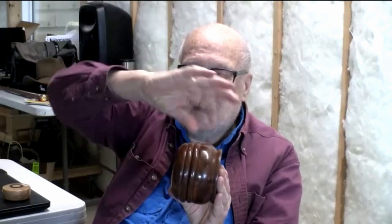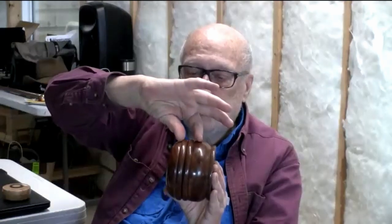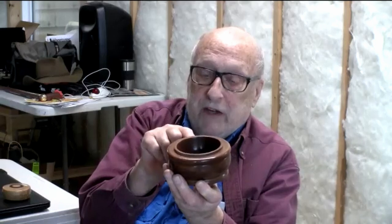That's an attempt to control the user from afar using magnets — the power of the universe. Boxes like this are made with a three-part blank: a piece there, a piece there, and a middle piece. You make these three discs with dead flat surfaces, then you take the middle piece and drill it from both sides, install the magnets with whatever polarity you want, then glue the whole thing back together into a log and part off in between.